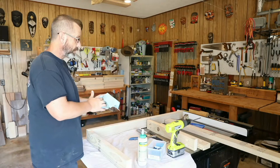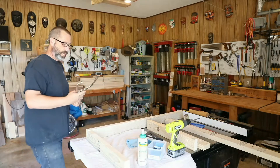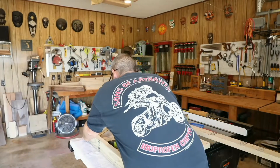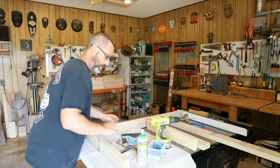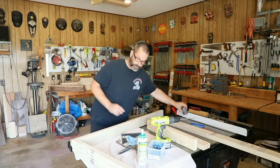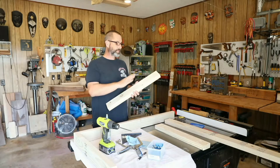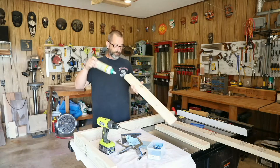I've put a towel down because I don't want to mess up the table saw table — better safe than sorry. If you've used a Kreg jig before, these clamps really come in handy to keep everything together while you screw it in. One down. Now on this long piece, it's 46 inches wide, so I measured 23 inches and I'm going to put this cross piece dead center. When you're putting these together, your cross piece is going to have your pocket hole screw holes on one side — it really doesn't matter which side, they're going to be hidden with the shelf over them.